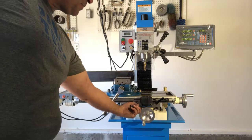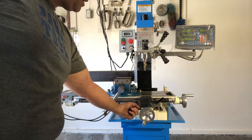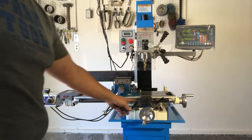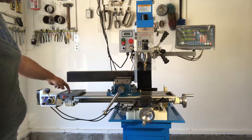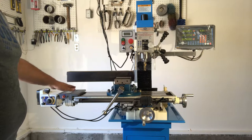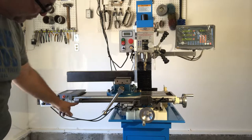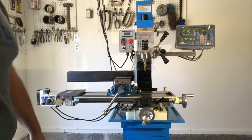The bracket that comes with the kit is too long, so you can just cut it — but I cut it and re-welded it. The other bracket behind it also had to be cut down so it wouldn't get in the way. One issue is it blocks the ball oiler. Also, this part of the power feed kit blocks a ball oiler for the Y-axis hand wheel, but that's not a big deal because you can always bypass the ball oiler and lubricate the ways directly.